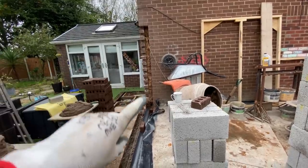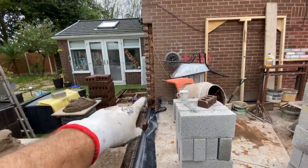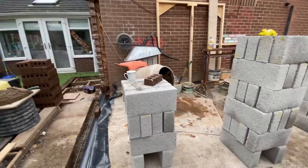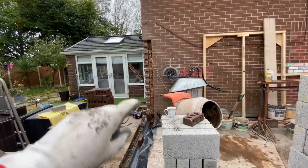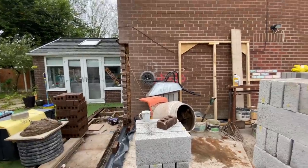So I've just averted a catastrophe there. I just nearly put a pig in that. I just nearly put 28 courses at this end down to 27 on the house. My God, thank God I checked. So I've got to recalculate now. I've got to recalculate 2085 divided by 27, not 28. And before I do that, I'm going to count again just to double check and triple check.